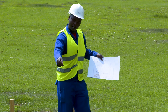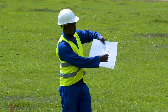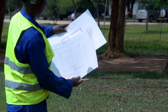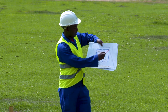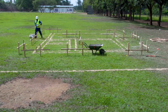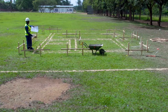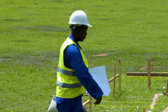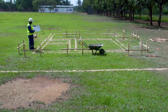We put a steel square so that we have a right angle here, and then we check the drawing and see the dimension from the center line up to E. It means we come to the dimension where we establish the back line of our building — it is from here up to here. From this E, we want to establish corner D. So here we put a steel square and have a right angle, and with the measurement we establish corner D.